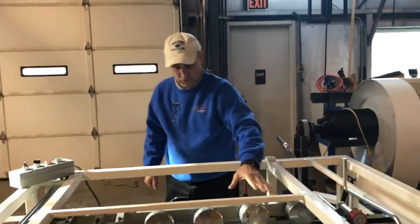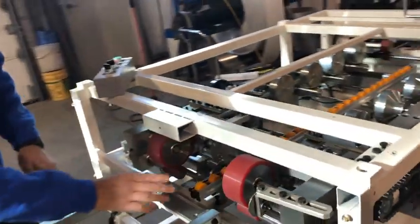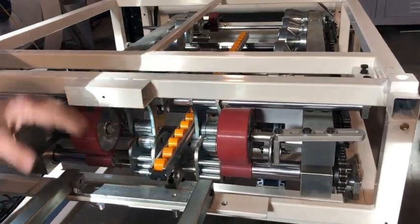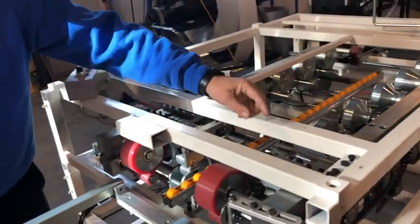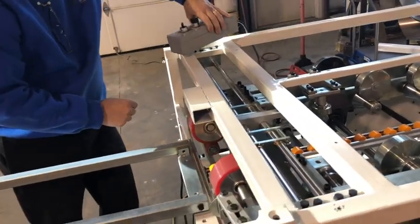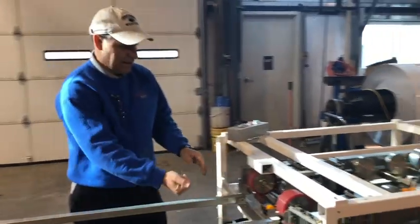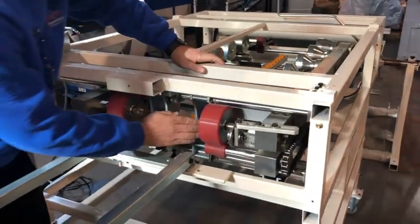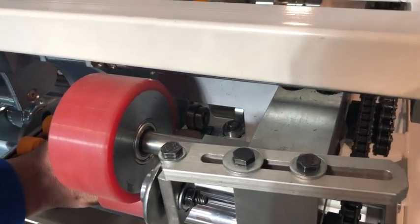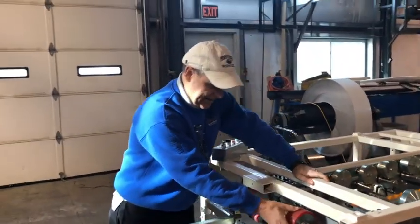It goes through your forming rollers and then it comes out to the very end, where we have two sets of bead rollers. You can adjust the height of them. If you don't want the bead rollers you can just raise the height with these screws at the edge and then they won't make any beads. Also on the end we have urethane drive wheels, and each machine we put a right and a left lip right on the edge for the clip. So this is clip relief, and finally we have the exit.